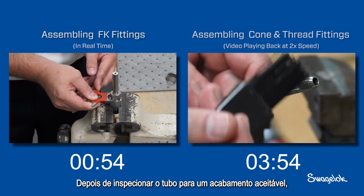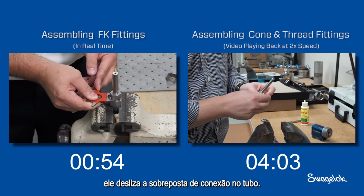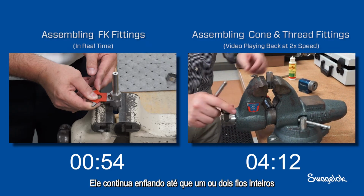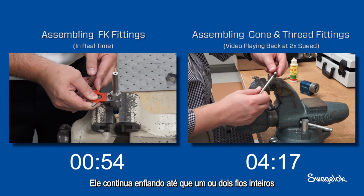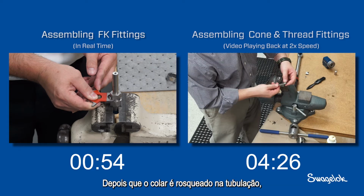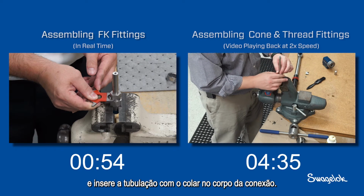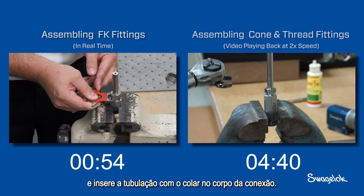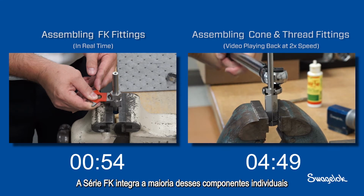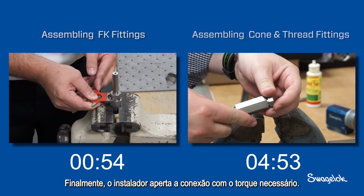After inspecting the tube for an acceptable surface finish, he slides the fitting gland onto the tubing. Next, the collar is threaded counterclockwise onto the tubing. He continues threading until 1 to 2 full threads are exposed at the cone end. Once the collar is threaded onto the tubing, the installer slides the gland nut over the tubing and inserts the tubing with the collar into the fitting body. The FK series integrates most of these individual components within the fitting cartridge. Finally, the installer tightens the fitting to its required torque value.